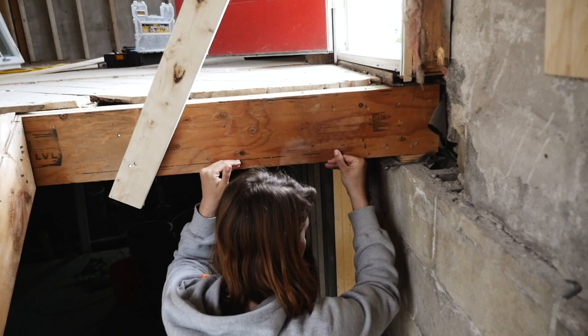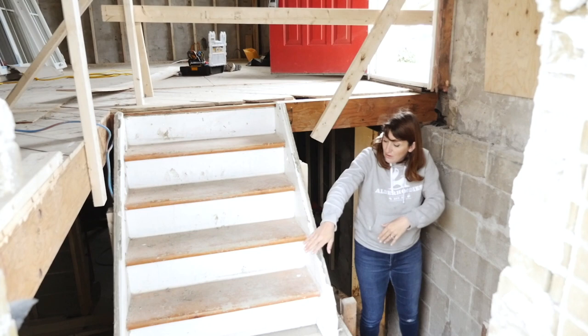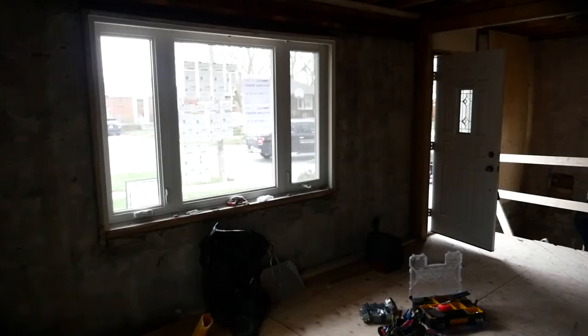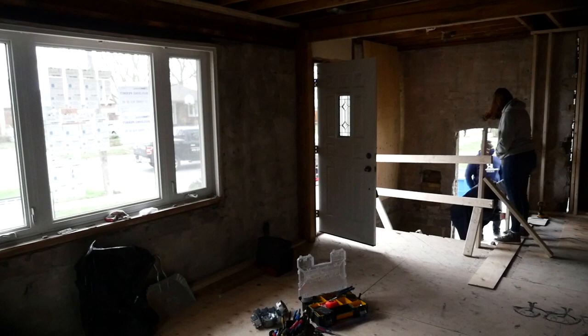It's all about playing with these inches and the height of this landing. If the landing is higher you can get rid of one of these stairs; if the landing is lower then you have more headroom going downstairs. That's a big challenge, and our friends over at JV Oaks are going to help us configure a new staircase for this glorious mansion of a bungalow.